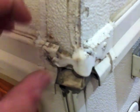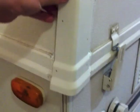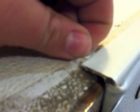I left this on the bottom here a little bit just so that it has structure for the new cap to go on. There is our new cap — it will fit right on here like that. What I do is take it back, take this dicor out here, pull all this out, just get a screwdriver under there and just lift this up a little bit so you can get this corner under.